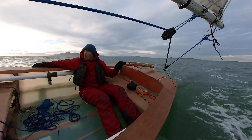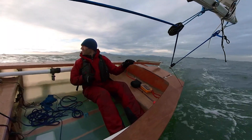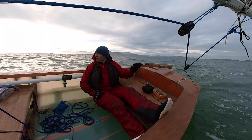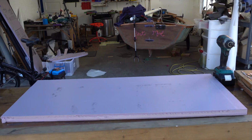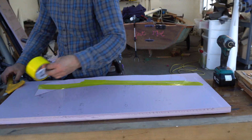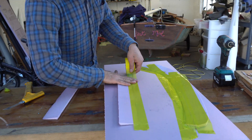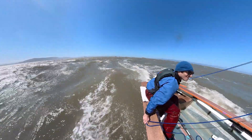I hope you like what I was able to grab from the process of creating this unique carbon fiber rudder using an inside-out additive approach that does not require making a mold and pulling your rudder out of the mold. There are some advantages of making a mold: the rudder probably would have been lighter, there would have been fewer filler ounces, and once you have a mold, you can make more than one rudder. But making the mold does take time and it does use materials. I am intrigued by some compromise approach — perhaps using pink foam with packing tape with some very simple angles as a mold. I am curious about making another rudder just to see if I can make it lighter.